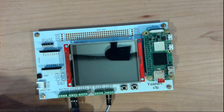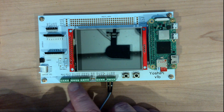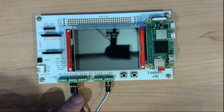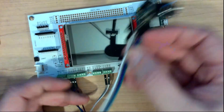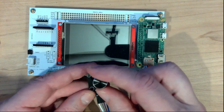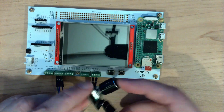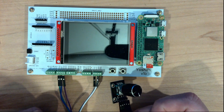What we're going to do is wire it up, and I've already connected here. We have three digital inputs — those are required. Two of them are for the phases of the rotary encoder, one is for the button. And then we have power and ground, and I'm driving this with 3.3 volts. It's connected up to the rotary encoder. When I rotate it, we're going to get pulses on D0 and D1. And when I push this in for a click, D2 is going to drive to ground.